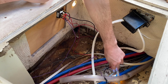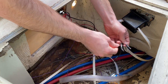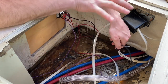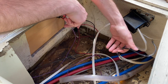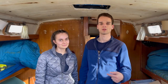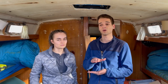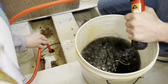Here is the jumble mess I have to figure out. The old bilge pump had some really funky connections that I cut out, and it had a relay that I also cut out because we took it all down — we thought we'd use a completely different system. But turns out this is what we have to go back to. We had a funky setup and the hose going into the bilge never reached the bottom, so we always had standing water — and honestly there was more oil in there than just water. It was really gross.